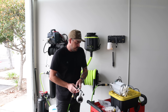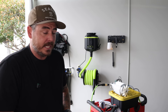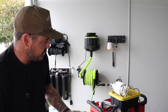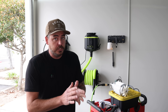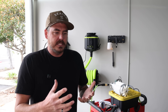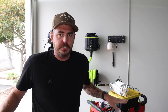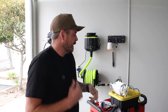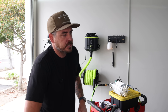I'm going to go ahead and plug the machine in. As always, especially for my recon on developing this thing, I want to test the amps, so we've got the amp meter set up — we'll test the PSI and the GPM. Noise-wise, one thing to note: this is an induction motor, so it should be on the quieter end. The casing we'll be putting around it will encase the pump to reduce noise as much as humanly possible, so the full production unit will be much, much quieter.